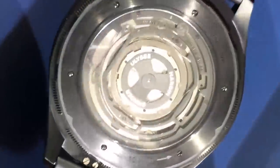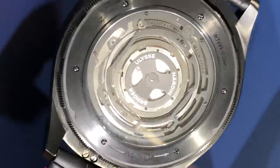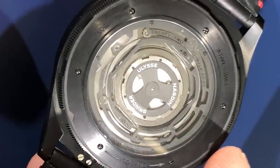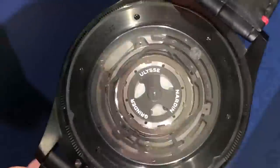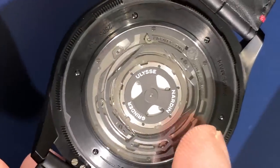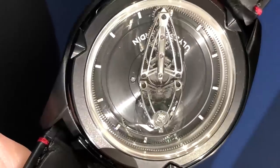Turn the watch over — you can see this is a prototype, early series, 45 millimeters as ever, 22 jewels, Ulysse Nardin caliber 250. You're looking at the extravagant grinder winding system — a winding system unlike any other that energizes the UN 250. With 22 jewels, it looks like anything but a winding system as the rotor is almost completely hidden. It's a thin, fine, and efficient pawl-based winding system that helps to energize this power-hungry timepiece.